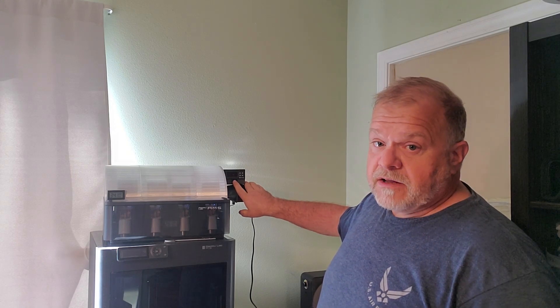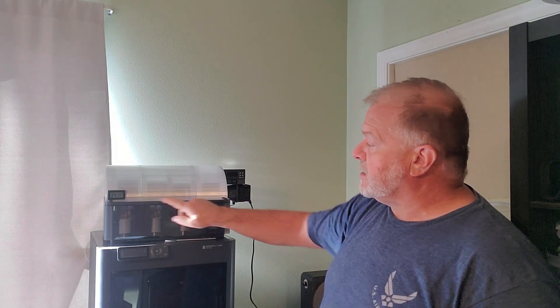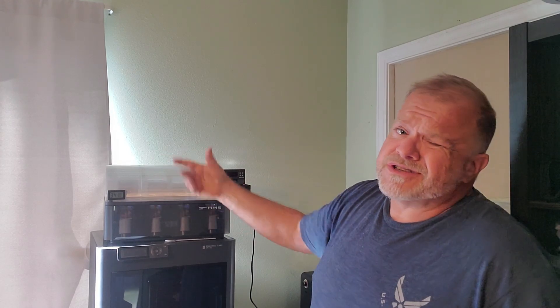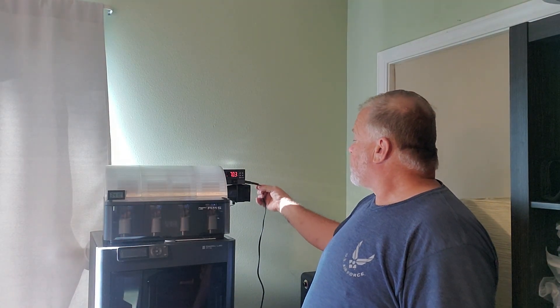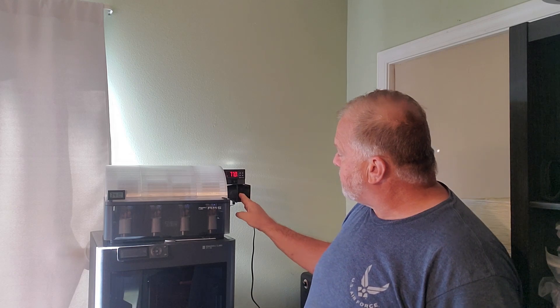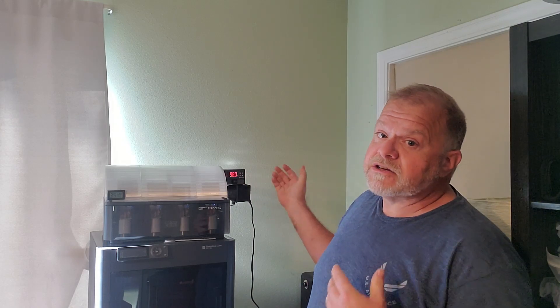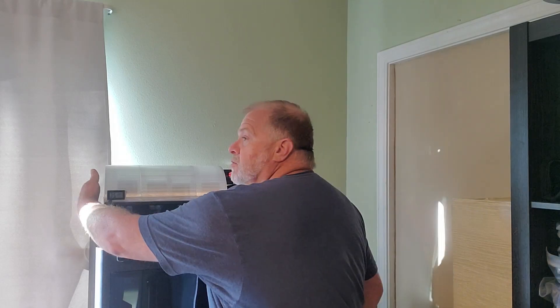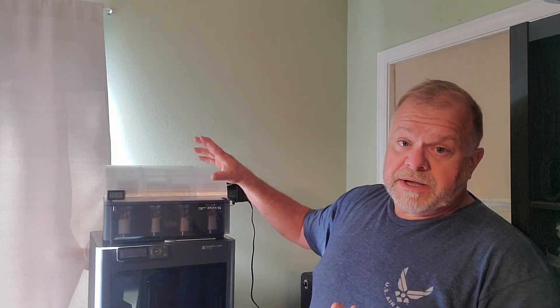I put an on/off switch here. I've got links for all the parts — basically just the thermostat, the switches, and the PTC heater. I didn't put a link for the screws because they're a dime a dozen and I got them ages ago. It's not really loud, but it does put out more noise than I'd like because the fan is right up against the PTC heat sink, causing some back pressure. You'll feel air on this side, but there's still air going through — you don't need much. Just a very light breeze — enough for the hot air to go in, pick up moisture, and go out.